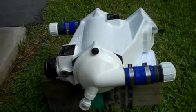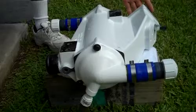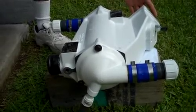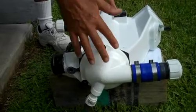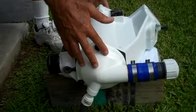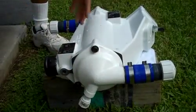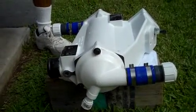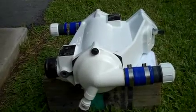You should get no water inside the housing where the airflow occurs between these two ports. All the water should be contained within the intercooler core itself, between the end caps. And you keep it on for a while, you double check it, make sure that there's no water inside, and then you can be sure that it will work properly.